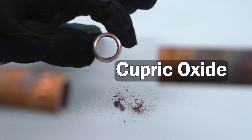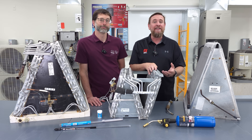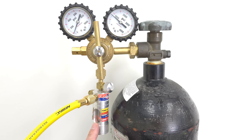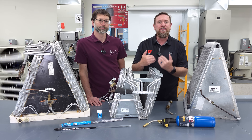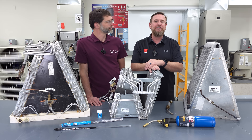Because we're using a lower amount of heat to fix the aluminum, we don't have to worry about the copper oxidation. However, it's still a great idea to flow nitrogen so that we don't end up with moisture contamination in the coils. And now that we have A2L refrigerants, we definitely want to flow nitrogen while doing any repairs, because we want to make sure there's no oxygen in there, so any possible remaining refrigerant won't have a possibility of igniting.